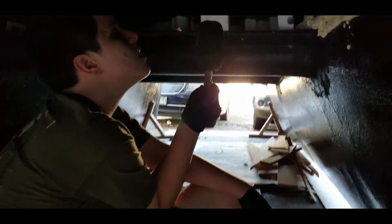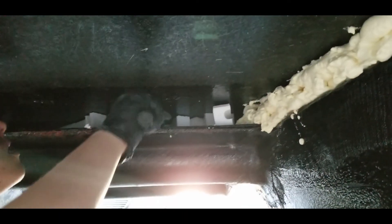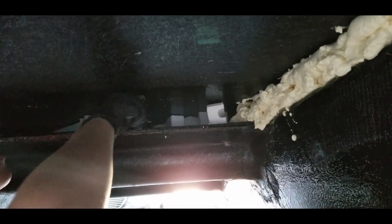The point of inserting the styrofoam between these supports in the deck panel is not for structural support — it's to help muffle the sound when you're walking around the deck, and also to provide a backing for us to come in and fiberglass, because we want to connect those supports to the deck panel.